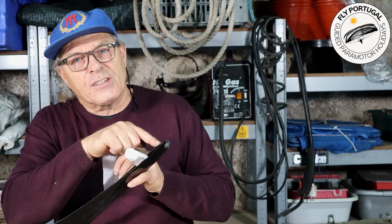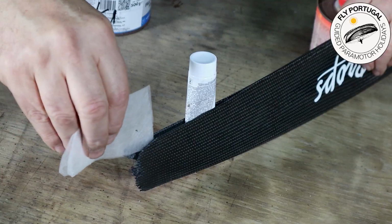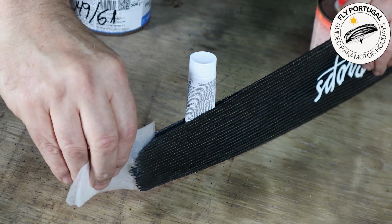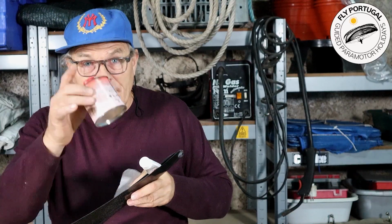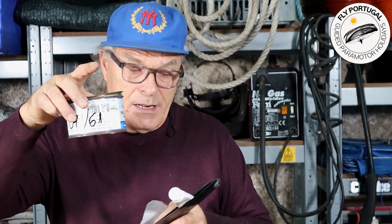When I repair these tips, I do it in 2 stages. The first stage is to take the fiberglass matting, insert it in between the prop and use resin to bond that in position. That makes a really good strong bond, and then down the seam in order to make a seal there. The second stage is to take the fiberglass resin and then build it up to exactly the profile that I want and that it should be.